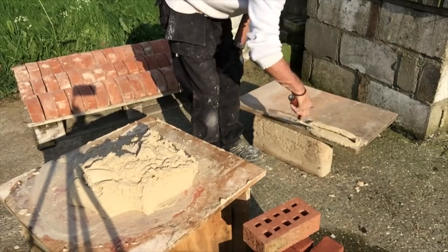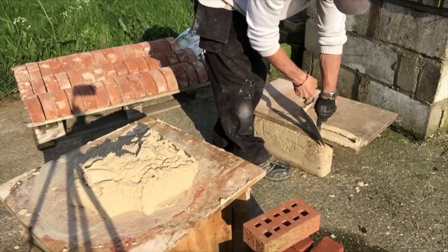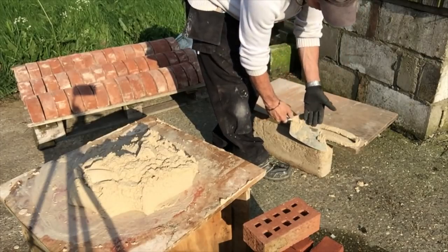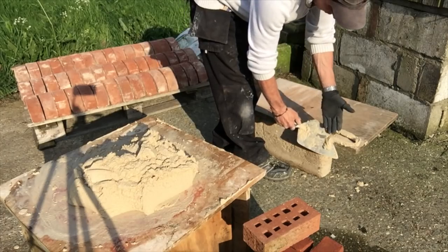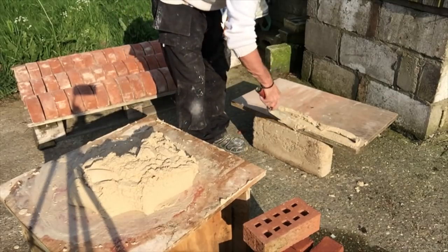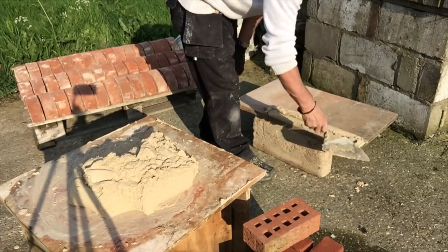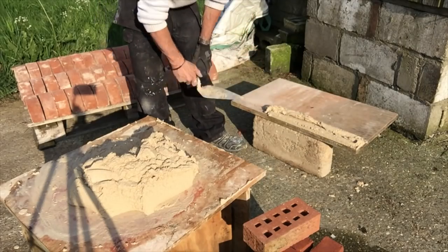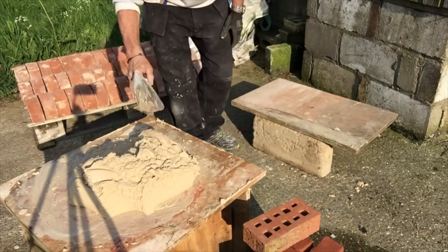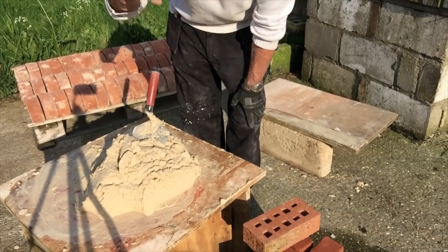It's down, 20mm away, and as I'm cutting you'll see the angle of the trowel. You're not like this — if you're like this then obviously the mortar you're cutting off will just smudge your bricks below and the brick you're going to be laying. So you make sure that you angle your trowel this way so the mortar just flows onto the trowel. That is the bed joint. Now what we'll do is have a look at the perps, and I'll explain the way I do it and why.